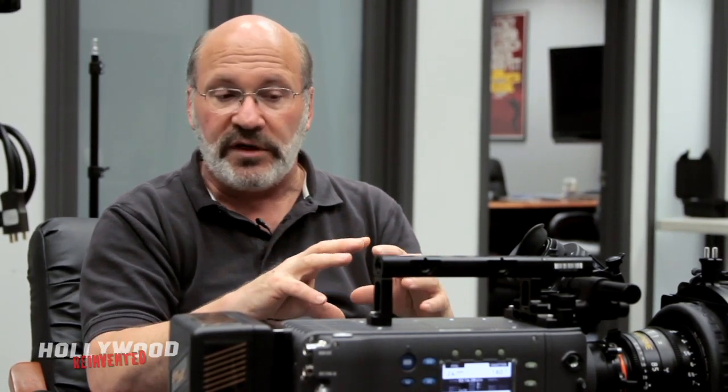Tell me a little bit about Arri's imaging technology — specifically the AIT. What that is is the way we take the light from the filter in front of the sensor through the entire process. We have a color bandpass filter that passes just the range of color that we see and filters out infrared light, with high-frequency information specially selected and formulated. We use specially selected and formulated color dyes in front of each pixel, then a software de-mosaic or decoding algorithm for the Bayer imager. The three together allow us to get a wide range of accurate color, good skin tones, and good blue screen and green screen.